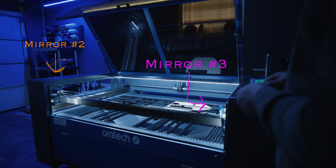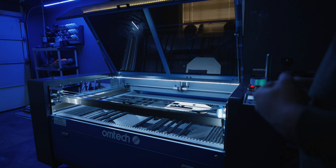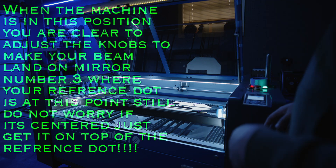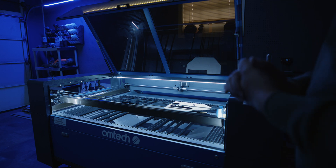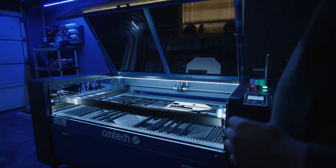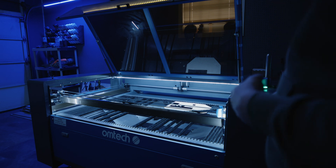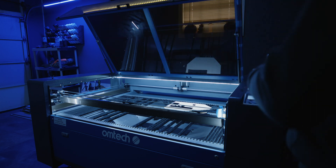The close position is a reference point — pulse but do not adjust the knobs on mirror number two in this position. Move your laser head all the way over to the front right, add a new piece of tape on top, and pulse again to see where the beam lands. According to where that beam lands, adjust the knobs on mirror number two to align toward mirror number three. The beam does not have to be centered — you just need all beams landing on top of each other. Use left, right, and up and down to move that beam directly on top of the other one.